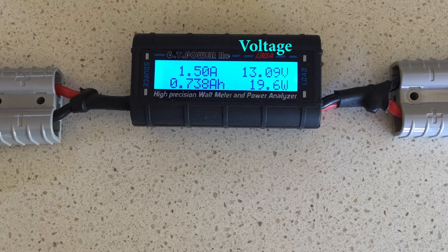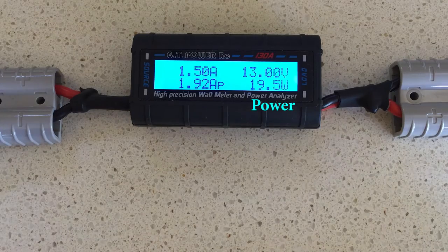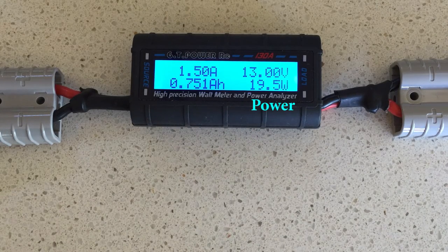On the bottom right-hand side, we see the amount of power being consumed on the load side. So if this were the case of a fridge or a light — say a 12-volt LED — this is telling you how much power has been consumed by that load. In our case here it's about 19.5 watts. As we know from Ohm's law, power is current times voltage, so we're simply multiplying the current and the voltage together. Those are the three instantaneous or real-time values that it reads.